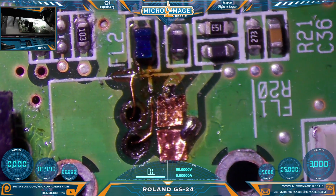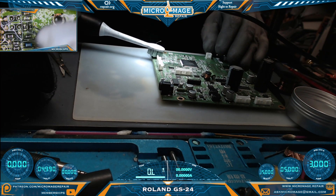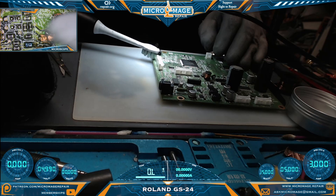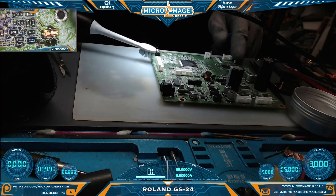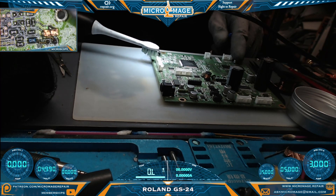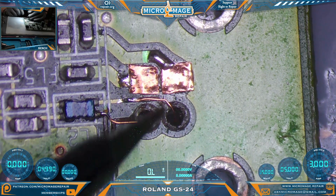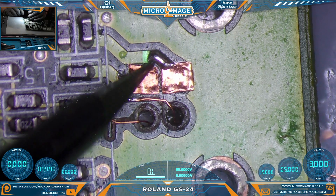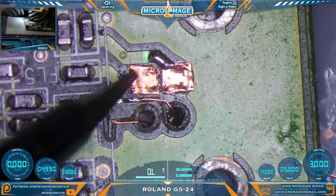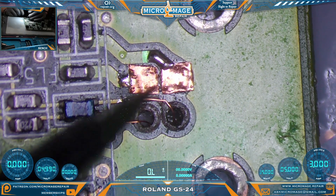We'll have to be careful not to break the wire. I will be deploying the ultrasonic toothbrush because we need it to get under those new copper pads and get as much of that flux as we can out from under them. The ultrasonic brush is very good for that. If you cure the UV mask over something that is unstable and will move, the UV solder mask will be unstable and crack and move. They're fairly close together, but not any more close together than they would be if you had the pads still there. I will be applying UV solder mask around these so they will be separated a little more, which will hopefully protect us from getting a bridge over on the pins.